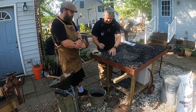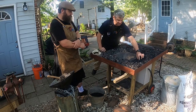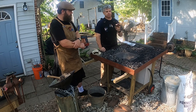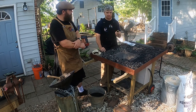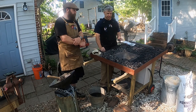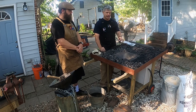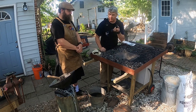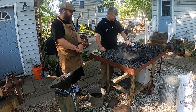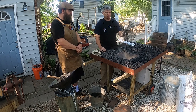And a lot of this actually, when you first start burning coal, again, this is soft and it's full of petroleum volatile derivatives, for lack of a better word. It's got sulfur in it too. When you burn this off initially, all of those volatiles burn off, so does the sulfur. This raw coal will produce a lot of coal smoke. It's kind of nasty, but as those volatiles burn out of it, it turns into coke, C-O-K-E. Coke is in essence purified coal that's burned all the volatiles off. This piece is very light.